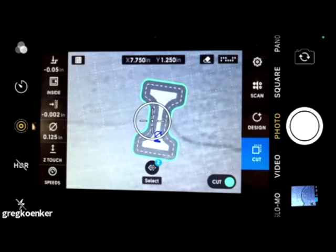You take your piece, you set it in and say, does that fit? Well, yes, it does. Okay, put a little glue in and hammer it down. If no, it's still a little tight. You go back and bump that up, and instead of minus 2 thousandths, you go minus 3 or 4 thousandths or 5 thousandths or whatever. It's pretty simple to get a really, really close fit.